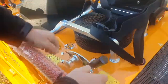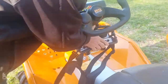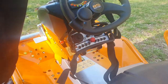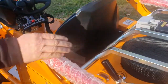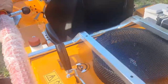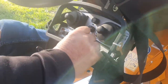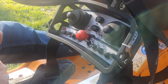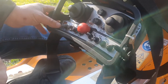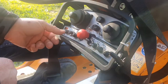Put the lever here into the manual position. Clip the remote control into its cradle. To start the machine, turn the rocker switch into the on position and then sit in the seat so the seat switch is activated. Turn this button and release. You'll hear the remote beep. The machine has beeped and you must answer that beep by pushing the horn button here. Once you've done that, you know the communication is established and you can start the machine.